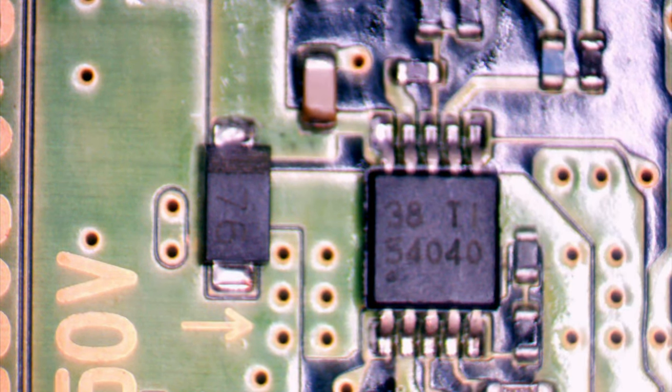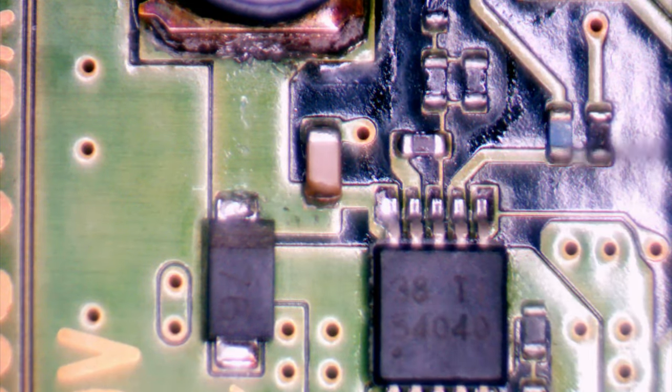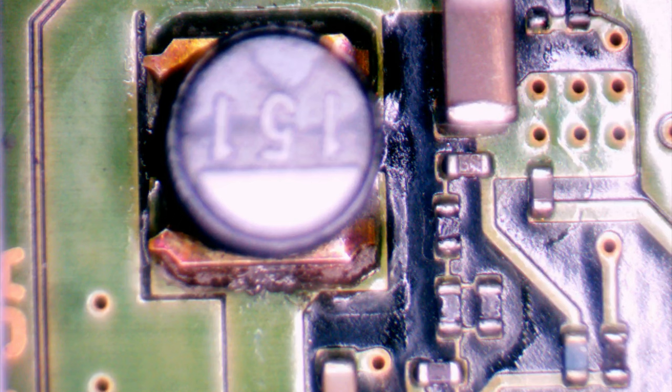The first thing I need to do is hook an oscilloscope up to the output of that chip, and it's difficult. It looks easy enough through the microscope but it's really hard to solder anything onto this board — it almost feels like there's a conformal coating; nothing seems to want to stick. I tried soldering to the capacitor — I may have damaged it a little bit, which is not looking good. I tried to solder to the diode and got nowhere, tried soldering to the coil — the inductor — too big a heatsink. So I'm struggling to connect anything to the output side of this IC.